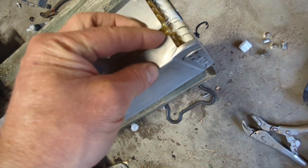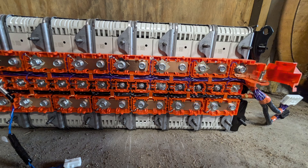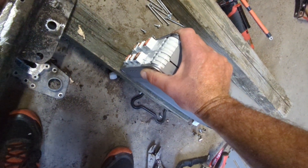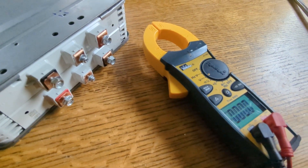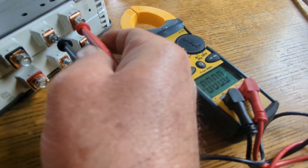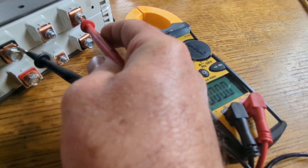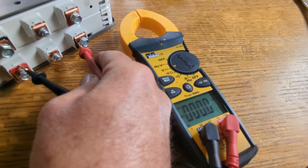These modules appear to be six pouches put together, but unlike others I've seen, there's no metal case separating them — no metal between the pouches at all. Maybe they're supposed to stay together as a pair, so rather than try to pry them apart right now, I'll do some more research. Let me check the voltage — from here to here we're getting 3.9 volts, and 7.9 volts across both terminals. Same top and bottom.